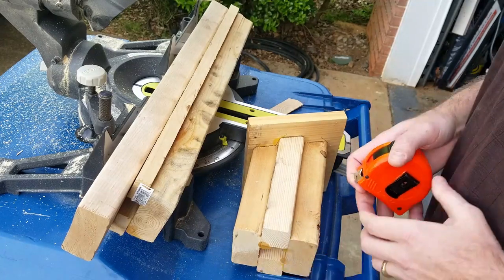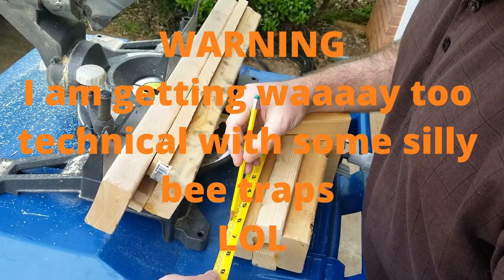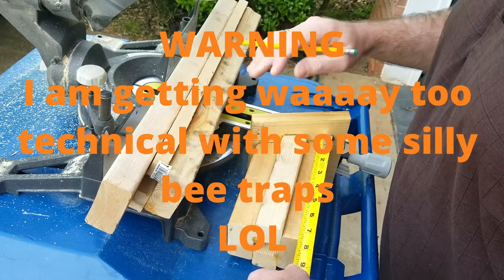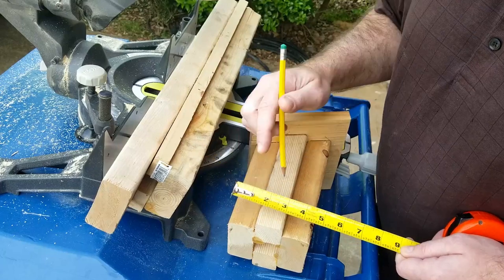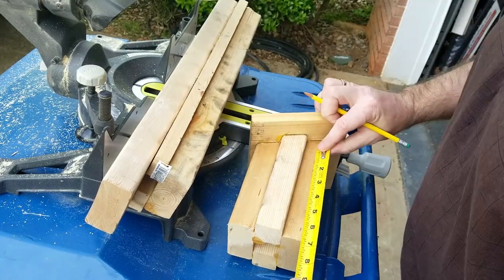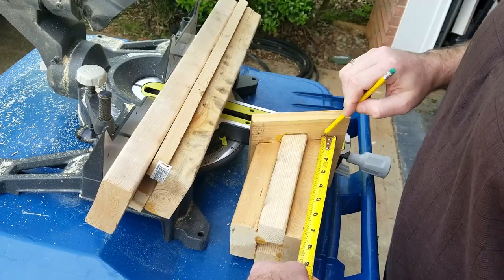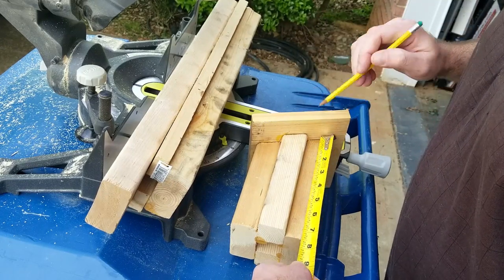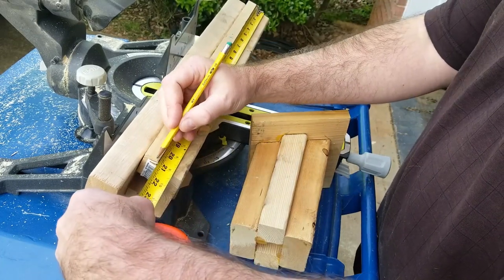So one thing that's kind of easier here. All right, so we can measure this side, and we know this is right at 6 inches. And then the width, which is right at 4 inches. So we come here to 4 inches and measure, and we've got 7.5. So this slant creates 1.5 additional distance. This is just over 21 inches long. I'm going to slice it at 21.